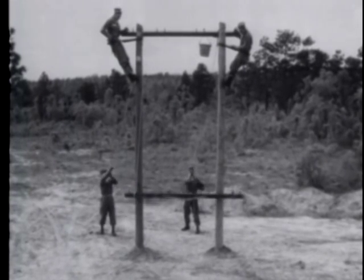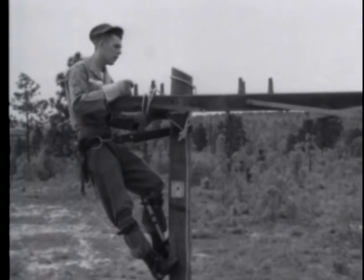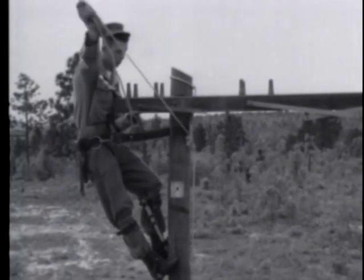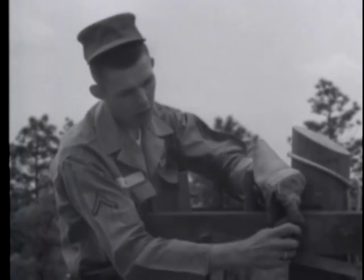If the holes of the first top crossarm do not exactly line up with the top holes on each pole, the horizontal distance between the two poles can be adjusted slightly in either direction for perfect alignment. Holes for the through bolts for an H fixture are bored 18 inches in from each end of the crossarms to accommodate B bolts.